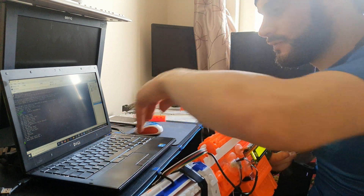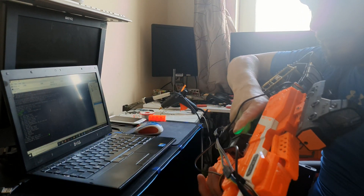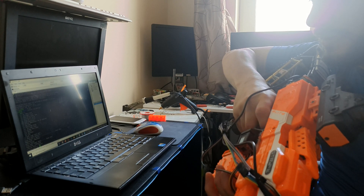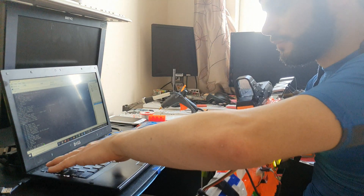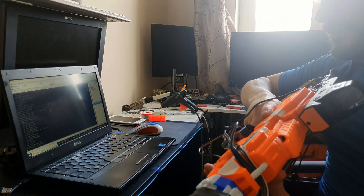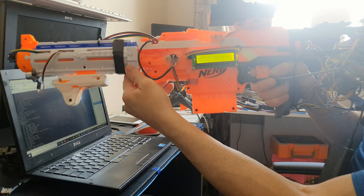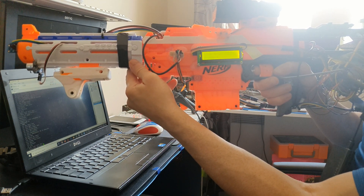Make sure my thumb is on the sensor. The fingerprint sensor lights up. I put my finger on there, template the finger, and there we go — it's successfully enrolled. Then I go to prompt user login, which is option 11 on the menu. As long as my thumb is still on the fingerprint sensor it should activate. I put the finger on there and it's logged me in. It says user 0 unlocked — that's the first user, it's zero-indexed. That should now be unlocked.